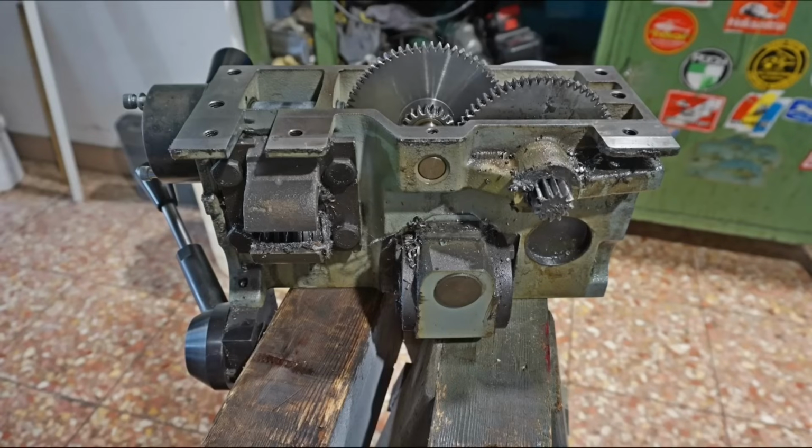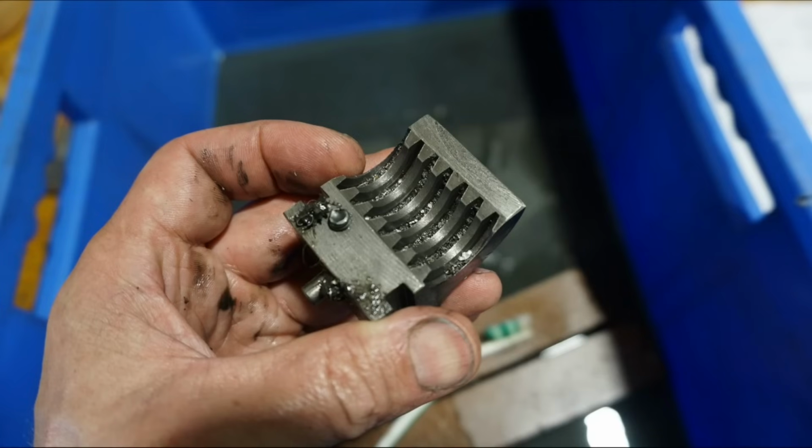With the bed slide top piece at the EDM company, I had some time to focus on the bed slide gearbox, which, as you can see from the picture, showed all those places with 35 years worth of grit and grime, places that usually cannot be reached for cleaning. So this was also a good opportunity to get rid of this mess. And I was particularly astonished to find how many chips had found their way into the relieved spaces in the clasp nuts. So also a good point in time to get rid of those.